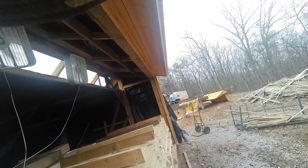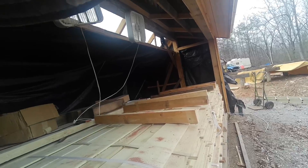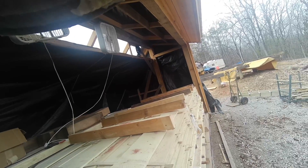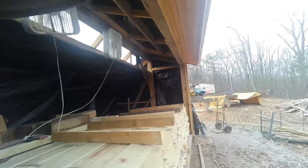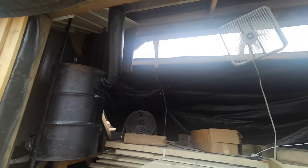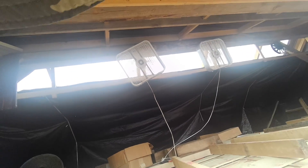If I get consistent shrinkage throughout the package, and since we've done this before, I know what it'll shrink down to even if it's left out in the sun for years. We're going to remove this package — I've got another batch of poplar back here and we're going to plane all this material and turn it into exterior vertical lap siding.